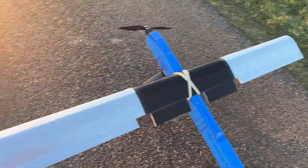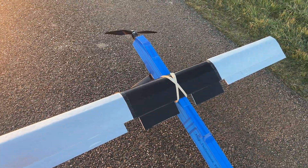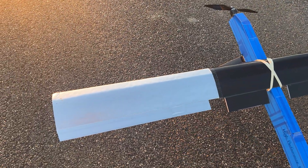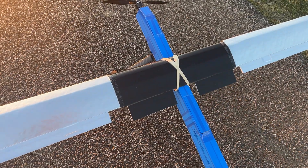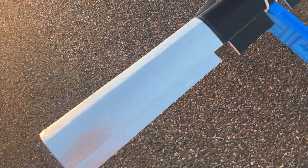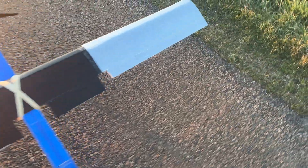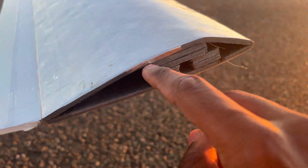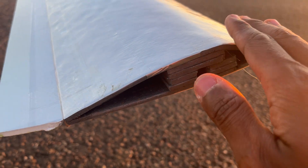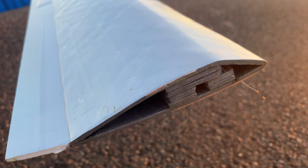This is a three-piece wing — 75 centimeters on the outer wings, fully made from XPS foam, including the formers. The center section is all foam board, including the formers. Because I haven't made the end caps yet, this allows you to see the inside, and it consists of four formers that create this quite thick airfoil, which is quite effective on this airframe.